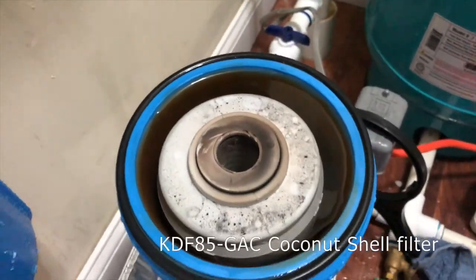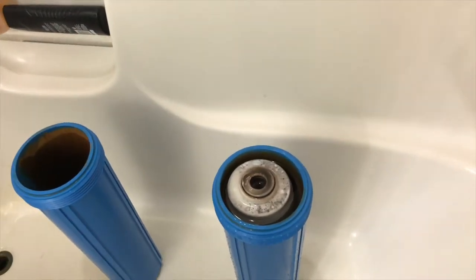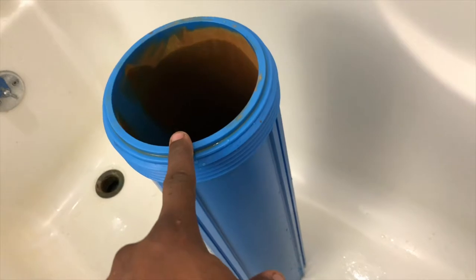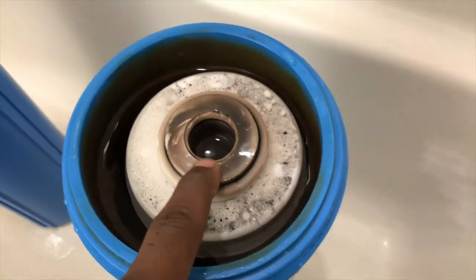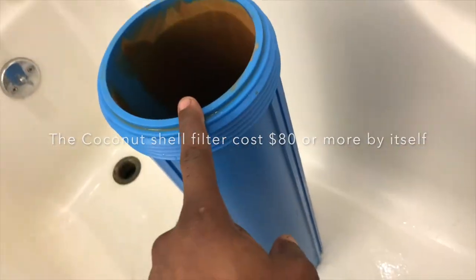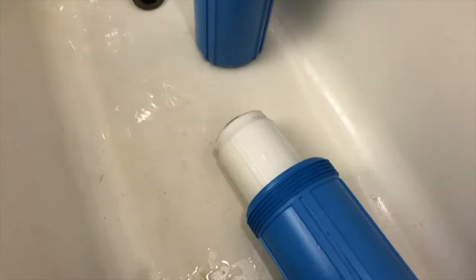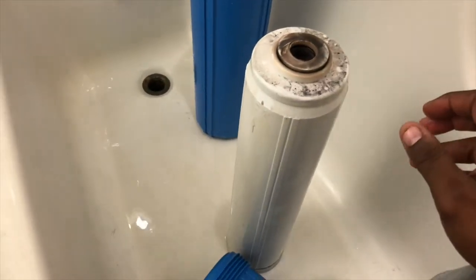The second one is out — it's definitely got some weight to it too. Let me get it in the bathtub and take a look. The filters I bought last time with the unit actually came with the carbon block filter, which was great, and a coconut shell GAC carbon filter. It's probably why it lasted for so long — because it had the coconut shell carbon filter backing up the carbon block filter, rather than just being a regular sediment filter. Now I only have the carbon block filter and two sediment filters. Let's pour it out — that's why the water's been so clear and tasting great.